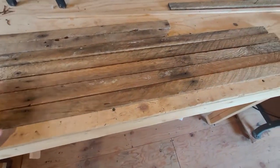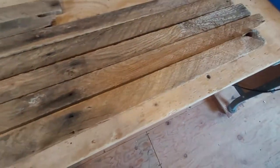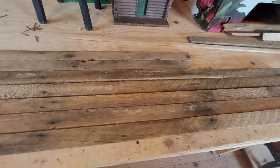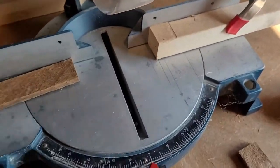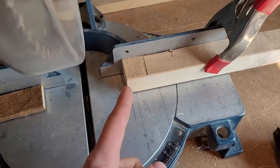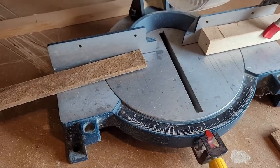For the past several minutes I've been pulling nails — I had to pull all the nails because I'll be cutting these down to size, and it's never good to cut through a nail, especially with a pull-down saw or a chop saw. To start cutting everything to length, instead of measuring and cutting every single one, I installed a stop block with a clamp at exactly two and a half inches from the blade. It makes life so much easier.